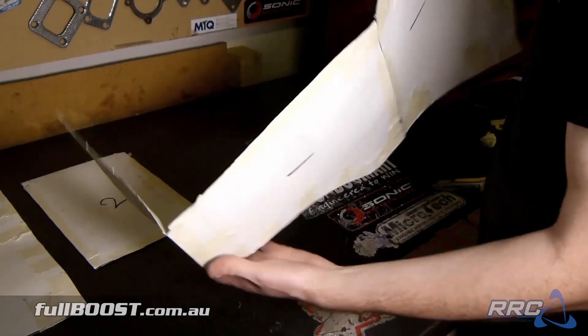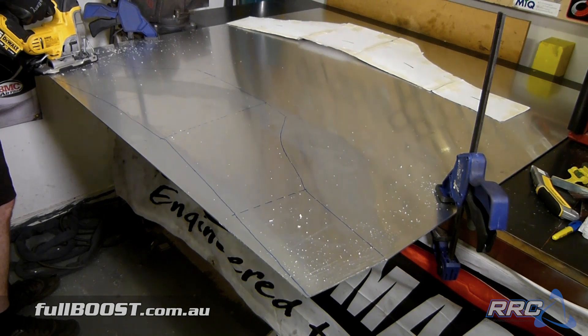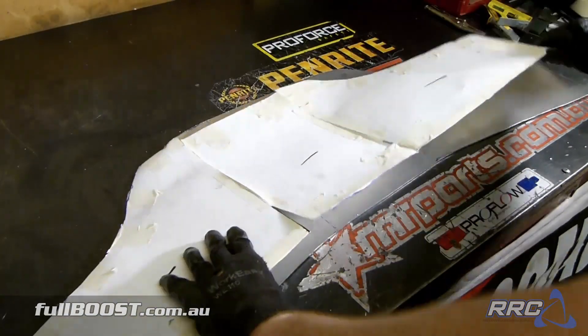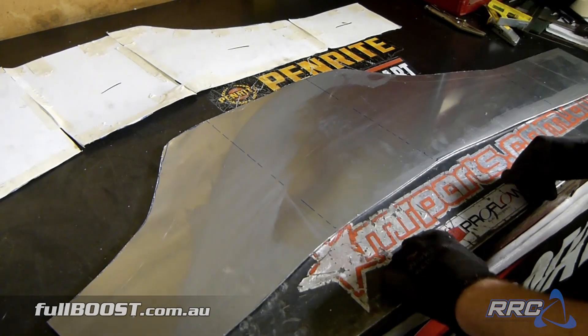Time for the serious stuff to begin. Starting by cutting apart our template, then tracing it onto aluminium sheet and cutting it all out into one big piece. Here's our template, and here's your alloy sheet. Next up, we need to turn this big sheet of aluminium — or for our North American friends, aluminum — into a shape that resembles our template. To do that, we need to head over to the bender. This bender we actually made on an earlier episode in the FullBoost tech file, so if you want to know how to make one yourself, check out the link in the comments. We need to put three bends into this flat sheet to get it into our box shape for welding.